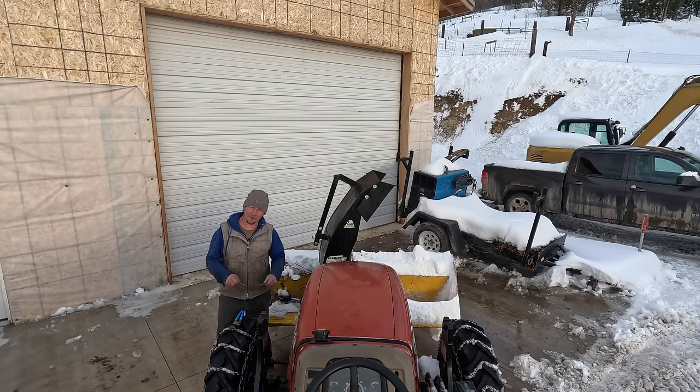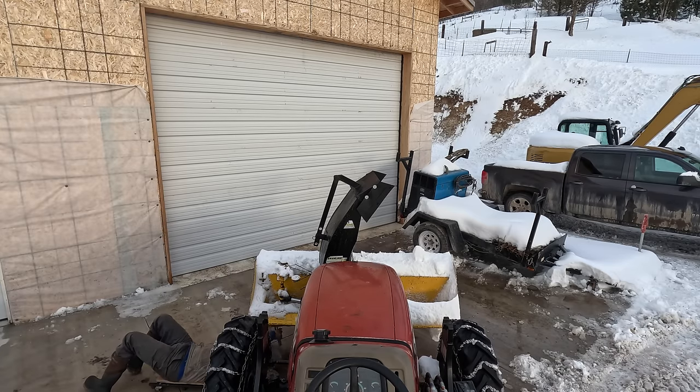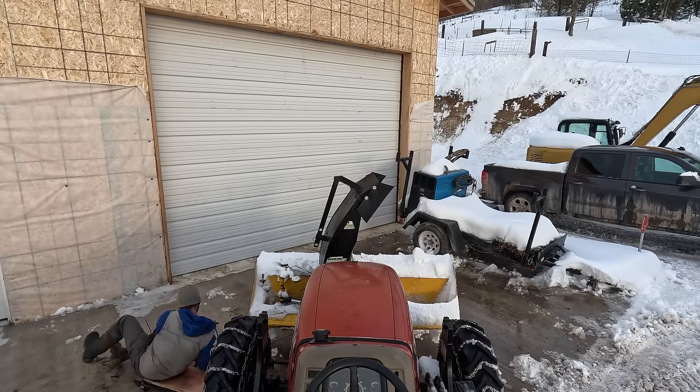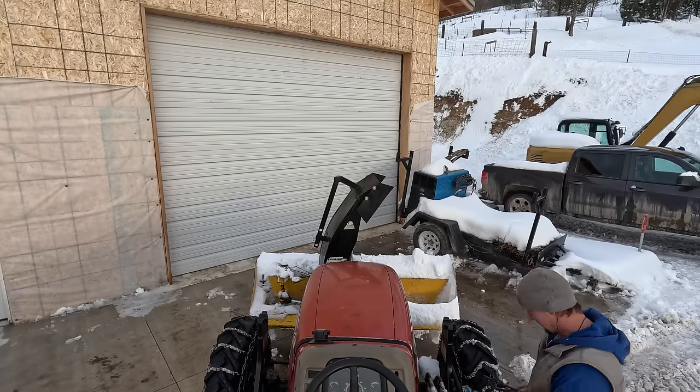What I do have is some 1/4 inch cold roll. I am gonna line that up, stuff this 1/4 inch cold roll through it, and bend it over and let it ride in there. I'm gonna take another one with me. This is much, much softer and should allow it to take a little bit of impact and distort a little bit while everything else slows down to catch up to the slip clutch. So that's what we're gonna do.